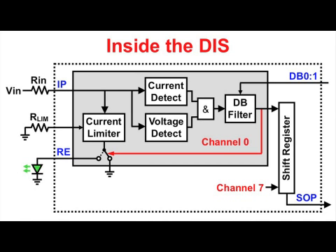The check for signal strength includes a current comparator that distinguishes between leakage and proper input current, and a voltage comparator that ensures the input voltage level is above 5.2V. If both comparators output high, a debounce filter delays the input signal by a user-defined debounce time. If the input signal outlasts the debounce time, it is accepted as a valid input status and the filter output changes in accordance with the input polarity.